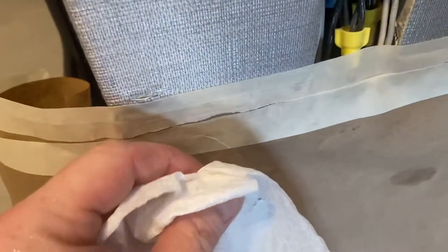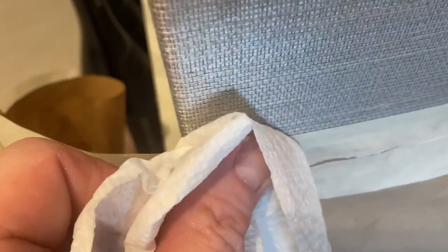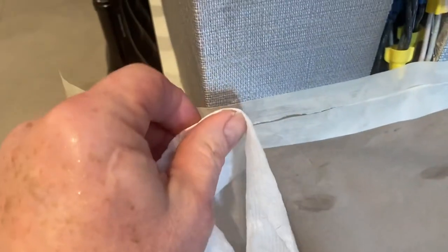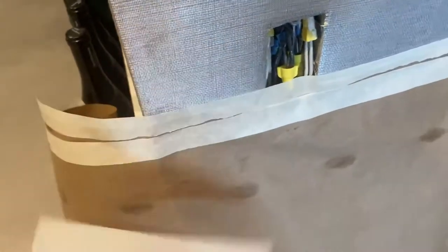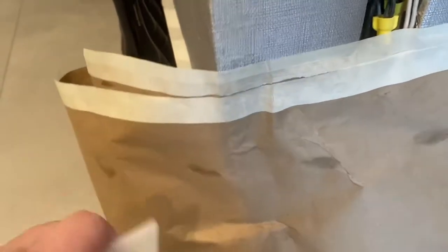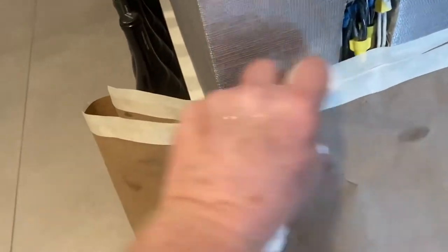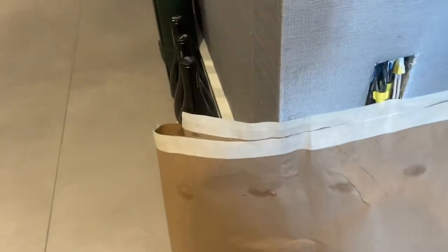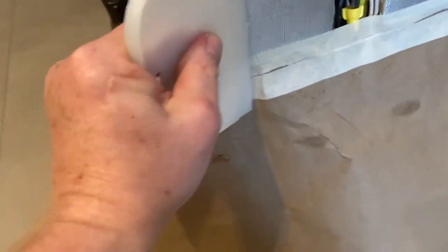We come out to meet the wall covering, from the space from the wall to the wall covering. And so we fill it up with paste with a syringe. That's essentially what you're doing. You're not going to be able to move this wall covering now that it's dry. But because it's so stiff, it slid out of the area of the corner just by maybe an eighth of an inch, 3/16 tops, and it causes this ugly, unsightly sagging.